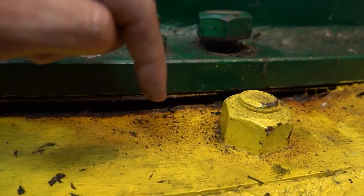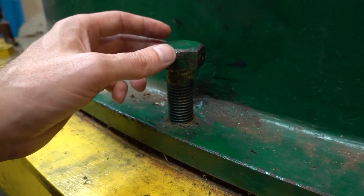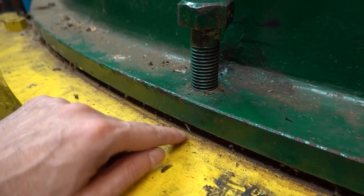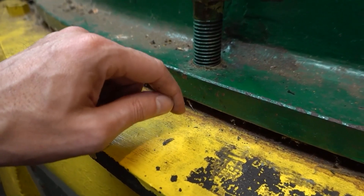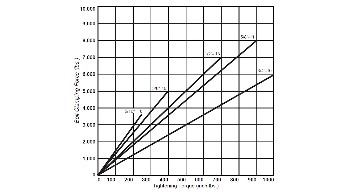There's another set of bolts that go all the way around, and these bolts — instead of being loose here and threaded in down below — are threaded in up here, and there's nothing under here except the steel plate. There's no hole for it to go into. So when you tighten these bolts down, it pushes against the steel and lifts up the housing. You can generate quite an impressive amount of force with that. This bolt is an inch thick. Let's see how much that's rated for — let's figure out exactly what the clamping force is on this.